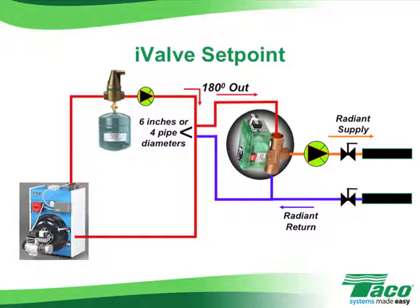The I-valve has an even lower CV rating than the three-way tempering valve. It has a CV of 3 compared to 3.8 for the tempering valve. Now that would create even more pressure drop issues on the system. Despite that, however, the I-valve can be useful when piped in a primary-secondary fashion, although like the tempering valve, it is best suited for smaller jobs around 4 gallons per minute or so.